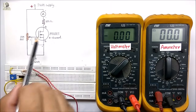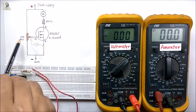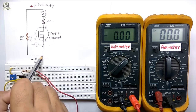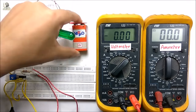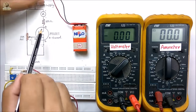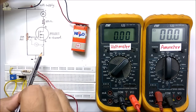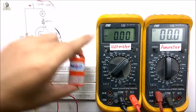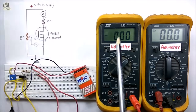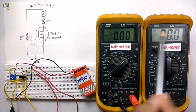If you want to take the test further, we can use a circuit to test a MOSFET. Here I am using a 10K potentiometer to vary the gate voltage with respect to source, and a 9V battery to supply the circuit. I have used a 100 Ohm resistor to limit the current between drain and source. You can see the circuit is very simple. These two multimeters will act as a voltmeter and an ammeter.